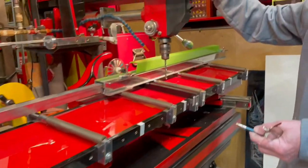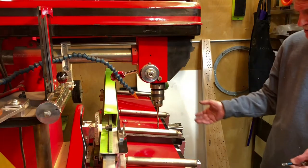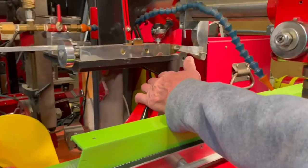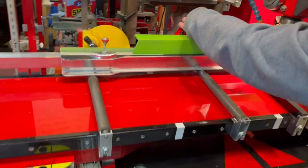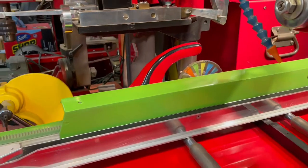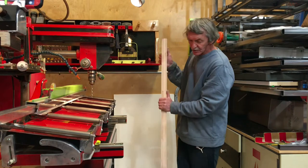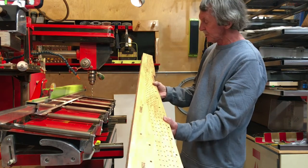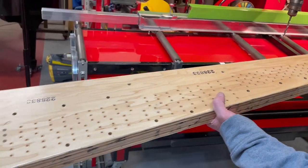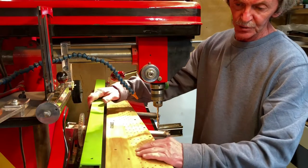As you see here, I have a handle and I can move the whole table back and forth. The radial press itself can be moved left and right to accommodate the angle. We have the main clamp for the pin block, a handle to move it back and forth, and a circle to move the pin block left and right to reach any desired position. The pin block is already marked with its positions — this is a Model A3, with all the hole positions already marked.